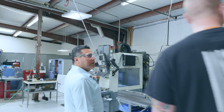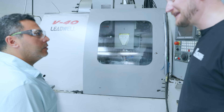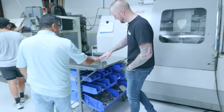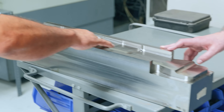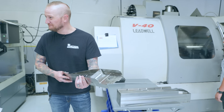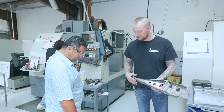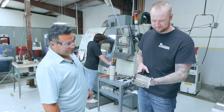This is a nice shop. I like the white floors — it means it's clean. That is a titanium part. What would the cycle time be on a part like that? It's also around 20 hours. You guys do some long cycles. We use two machines on this one. This is the part after roughing — here's a finished one. Look at the comparison: this is the block when it starts, and 98% of it is gone. I can see why that program takes so long — it's strong material, tight tolerance, thin wall. For titanium tooling, we use 5-flute end mills and lots of trochoidal milling.